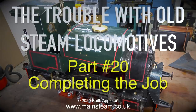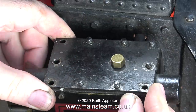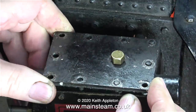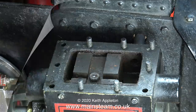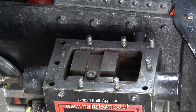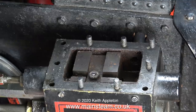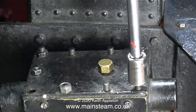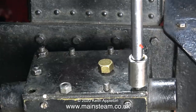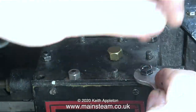The trouble with all steam locomotives, part 20: completing the job. I thought it would be a good idea to have a look inside the steam chest to see what the valve events were, just out of curiosity, because as you saw in the last episode the engine runs okay. I've removed the bolts and I'm removing the steam chest cover. I'm going to rotate the wheels and see at what point the slide valve uncovers the ports at each end. It seems okay - if anything the timing is a little bit retarded, but I'm going to leave it as it is using the logic: if it isn't broke, don't fix it. Nothing else on this small locomotive could be classed as being perfect, and at this stage I'm not going to go into obsess mode by endlessly tweaking the slide valve. Besides, with this valve gear there's much more than the slide valve to be taken into consideration, so this will work fine.